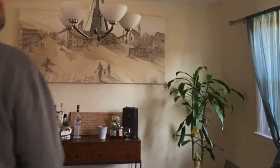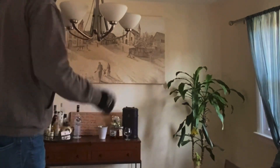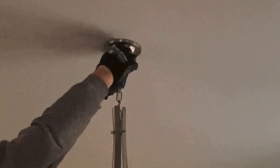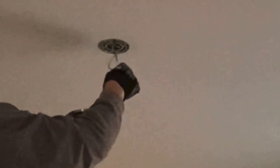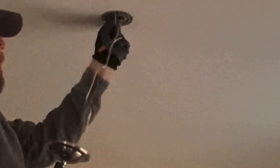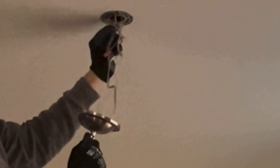The first thing is to get this old fixture down. I'm going to remove the screws on the cover. On this light fixture, these screws are what's holding the light fixture up to the ceiling electrical box, as you can see here. Here I am trying to get the wires out without damaging them or scraping them on the metal bracket, so I can disconnect the wires and lower the old light fixture down safely.